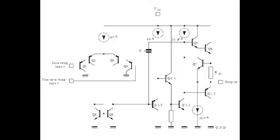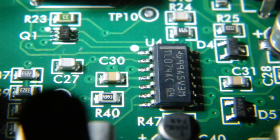Some people in the do-it-yourself community report problems and prefer the LM324 IC, but the reported problems, mainly with negative signals or signals of levels near 0 voltage, can be solved by applying some precautions to the power supply of the TL074, something what Moog definitely did here. The whole VCO circuit is quite basic, quite standard, and very, let me say, Moogish. More analog is not possible.